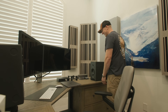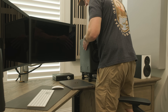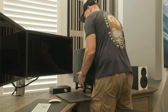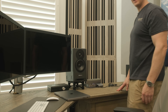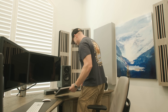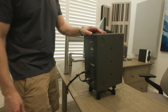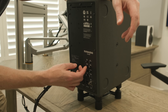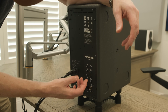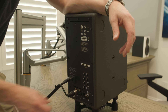If I can squeeze this little cutie into this spot — it's going to be a little tight. Actually, I've got plenty of room — look at that! There's no reason why I can't do this. Look at how good that looks. It even fits on the little standard Aperta. So we take this, go analog in, three-prong XLR connection. Set it up: standby, full, dark. This is the left speaker. We'll go free, free, and start like two clicks up on the volume and play with it in a minute. Make sure your left and right speaker settings match.